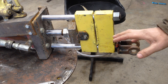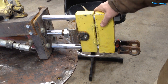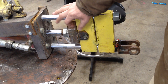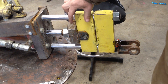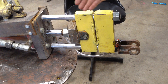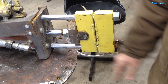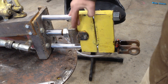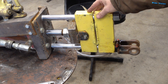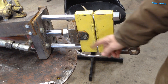The problem I need to address: on this design I put these tabs here so the bolt would be here, but it's a three-quarter inch hole in this plate with a half-inch bolt, so when I retract it's actually got some slack in it. This plate will come away from the other plate just a little bit. I saw this design on some commercially made shears and presses — it's a good idea because it helps save your rod if something gets in a bind and twists. But with the die I'm building, I need it to just be on the push plate. I'm toggling back and forth between making a new push plate — but I really don't want to swap this push plate just to swap dies, that defeats the purpose. So I think I'm going to actually cut these ears back off.